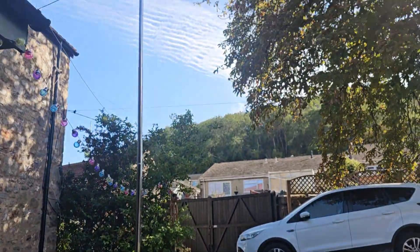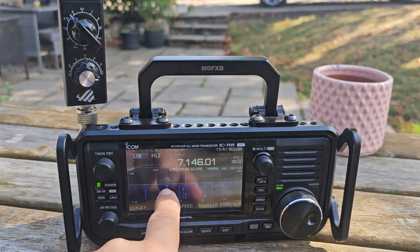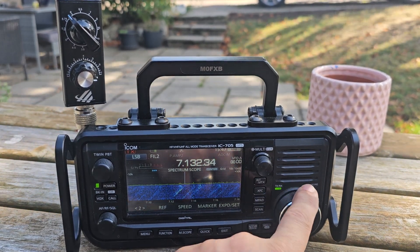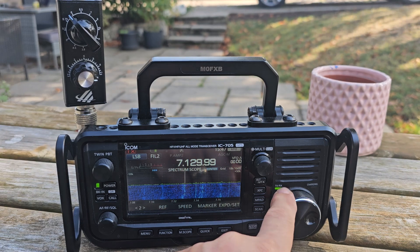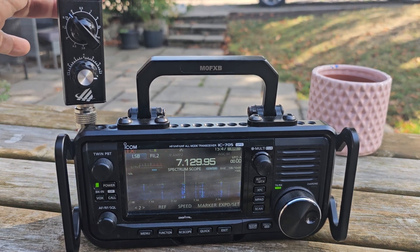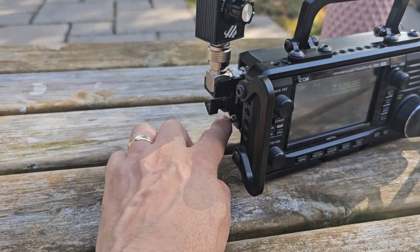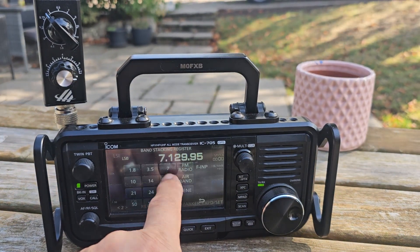The way I look at it is that it's usable and very compact. You can go on the two-meter band as well. These antennas are designed so you could add a long wire — there's a connector there. You could also ground this; on the 705 you've got a ground point, and adding some ground is definitely going to help. Let's try two meters.